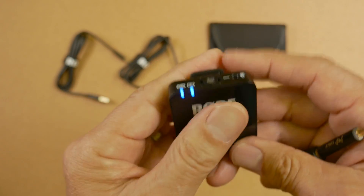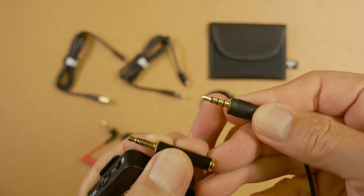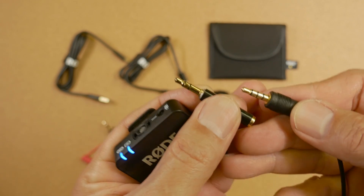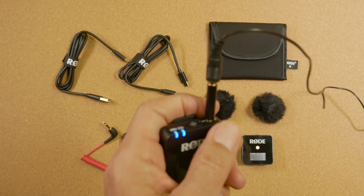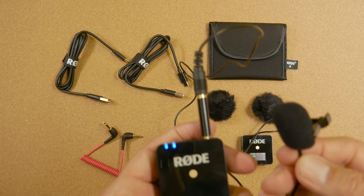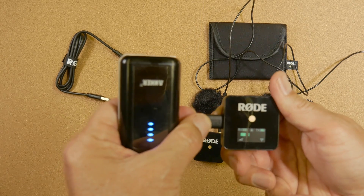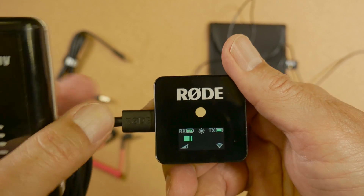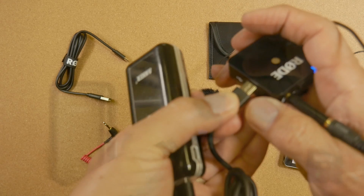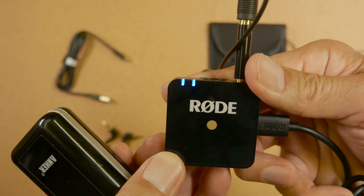Let's take a quick look at connecting a microphone to the transmitter. With my lavalier mic it actually has a TRRS plug, so I needed an adapter from TRRS to TRS — plug that into the transmitter and you're set. You can power up both the transmitter and the receiver while in use. I have a power bank hooked up and if you look in the top left of the display you'll see a tiny lightning symbol indicating it is being charged. On the transmitter, the power indicator light flashes on and off to indicate it is being charged.